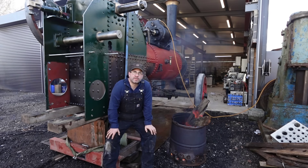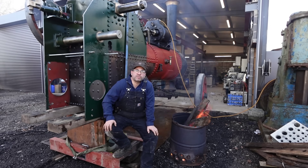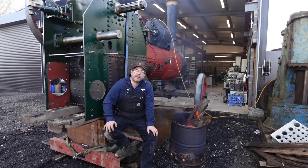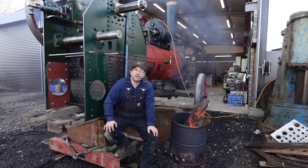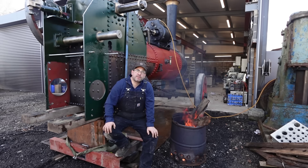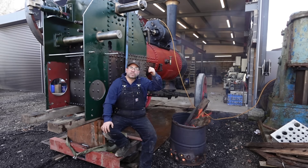So the plan — what we're doing is what they call a hydraulic test. These boilers, every 10 years, need a hydraulic test. It's where you fill the boiler completely to the brim with water and then you pressurize it to one and a half times its normal working pressure. Seeing as we've added all these parts off of this engine, we need to check all the seals, the rivets, the carrot bolts, all the gaskets we put in, and we need to make sure that's all going to be sealed up.